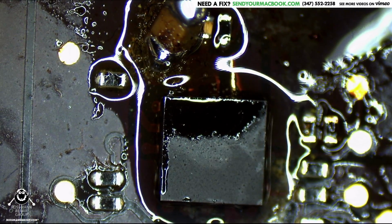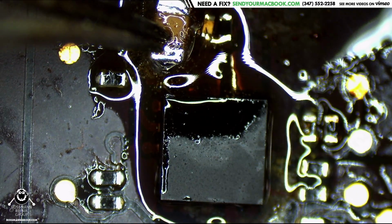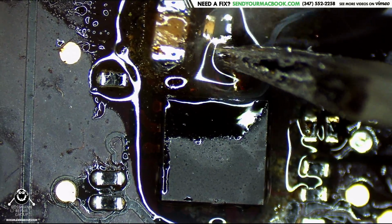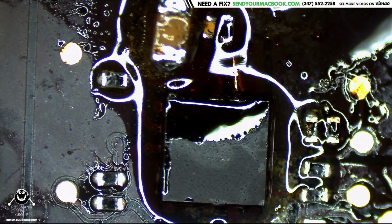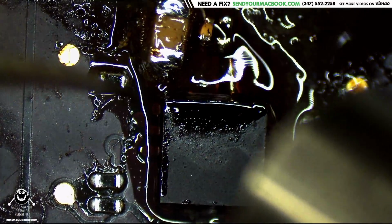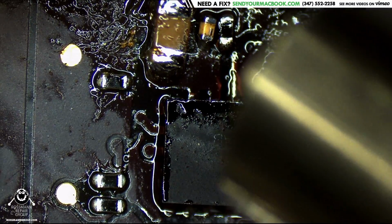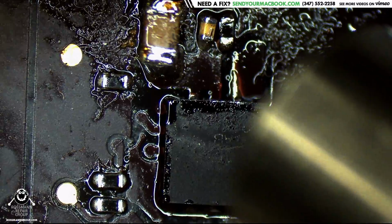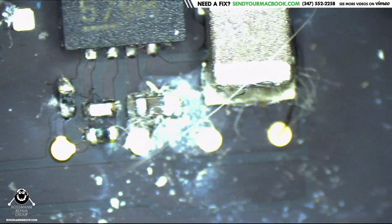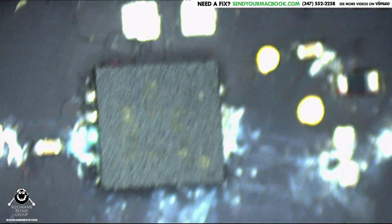This was a bit corroded. Perhaps I'm being a bit OCD with it, but I don't like leaving that bit of corrosion. Some stuff I'll trust to the ultrasonic cleaner, other stuff I kind of want to do myself. This is the basic PP3V42 corrosion that I would expect from this type of spill, and a little bit of SMC reset corrosion. I'm actually surprised the SMC reset chip is doing its job.